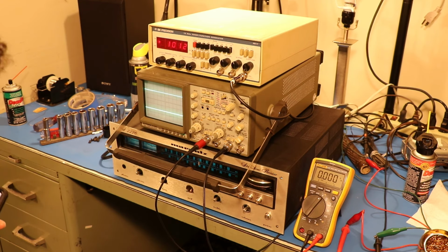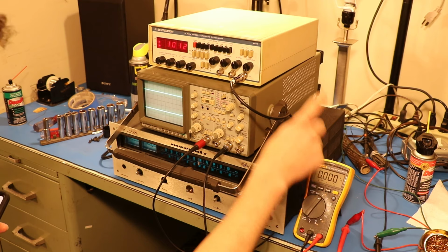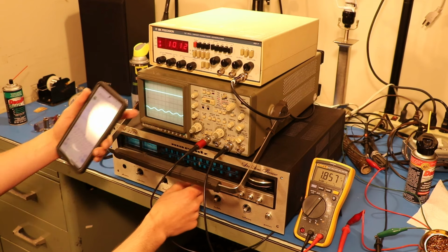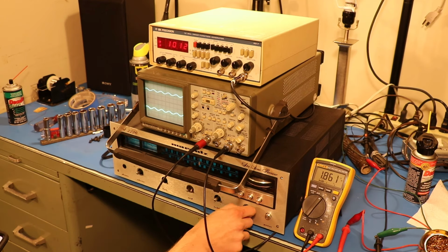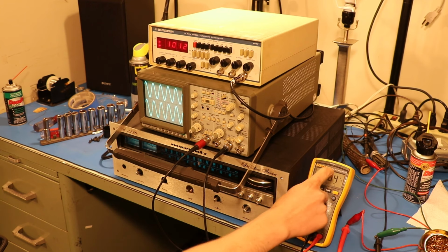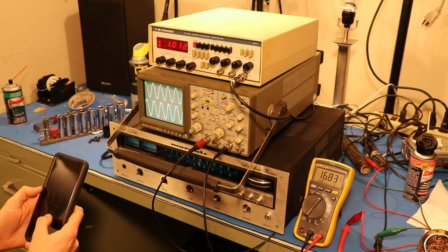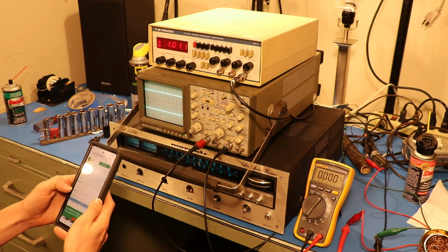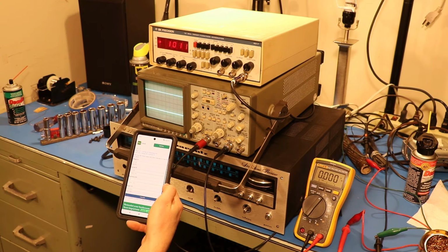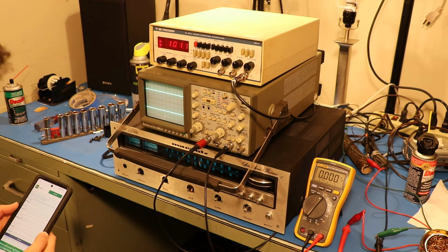So we'll turn that off because we don't want to blow our ears out. Right now this multimeter is measuring across the right channel. So I'll show the balance slider. The right channel is going to be our bottom one right there. So we're going to turn this up, and we're going to wait until we see stuff like that. But what we want is the point at which that is being induced. So I'll turn the volume down so I stop seeing that fluttering. And we see we have 16.84 volts AC right there. So we plug that into Ohm's Law calculator. That is 35.45 watts. That's a little more than 26, I gotta say.